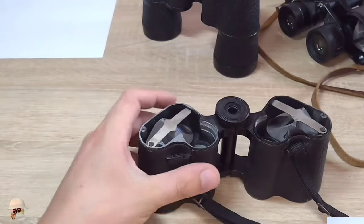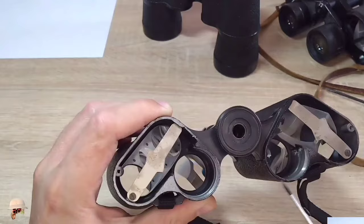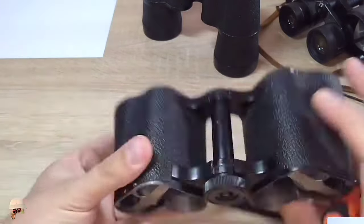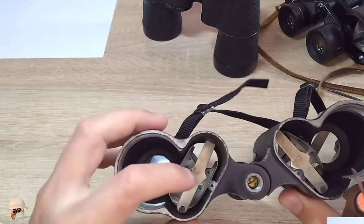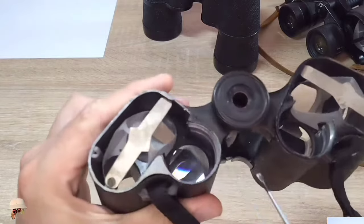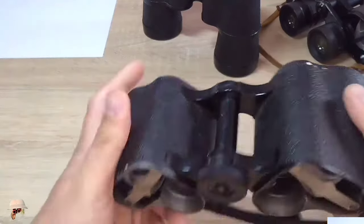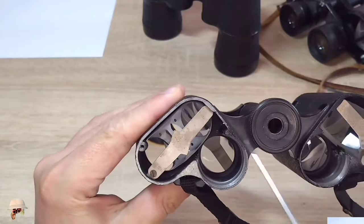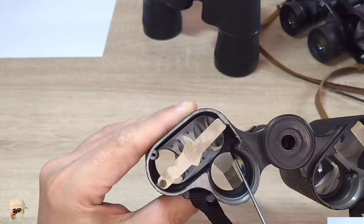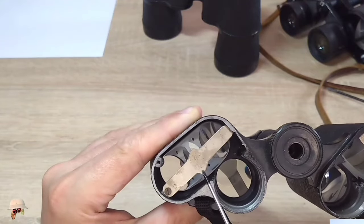Another way to adjust binoculars is by using prisms, and here we have a few options — more reliable and less reliable ones. It is all about the way you tilt the prism and the perspective it provides. The prism can lean in different directions. There are screws in this location, and when you tighten or loosen the adjustment mechanism, the prism tilts accordingly. This is quite risky in my opinion, because you can compress it and the prism will suffer damage — it will develop a chip. That is why I attempt not to tighten or unscrew these screws at all. Instead, I try to remove them entirely and place folded aluminum foil in multiple layers on top, ensuring it is completely covered and sealed.